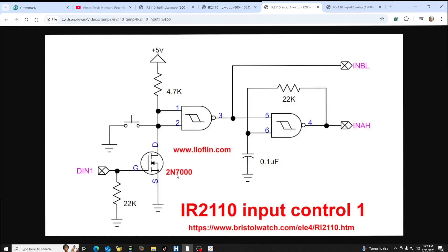When the MOSFET is turned off, the line is pulled high through a 4.7k resistor, and that is inverted to a low out on pin 3. As long as this is low, the square wave generator — composed of the second NAND gate — is turned off. You turn on the MOSFET: this goes low, which changes to a high, and that goes to the input of the B circuit low, then the output of the square wave generator goes to input A of circuit A high.